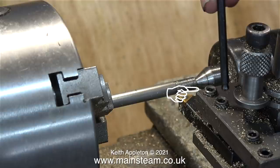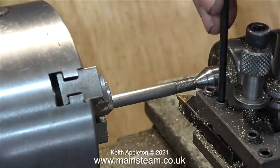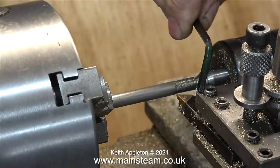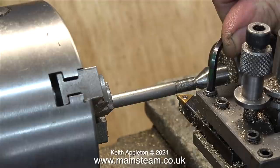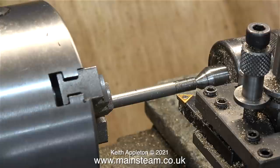The first job is simple — I'm just moving the cutting tool further out. This is a quick reminder not to use the ball end of Allen keys for high torque applications. Allen keys with ball ends are useful because they fit into the socket at an angle, which is convenient, until the ball snaps off in the socket. I speak from experience — I always use the straight end for high torque applications like tightening Allen grub screws.